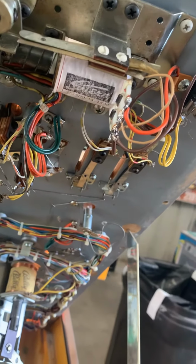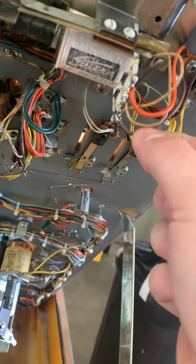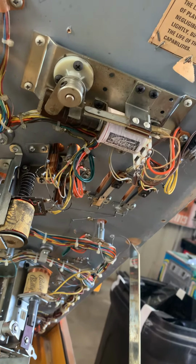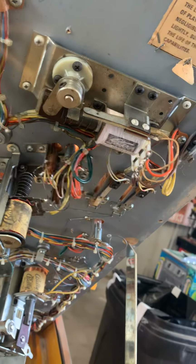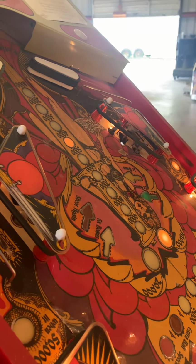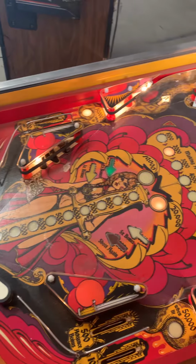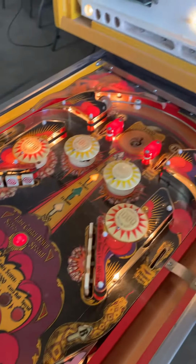After replacing the missing flipper coil and restoring the connection from this to all the other solenoids, we've got a flipper again. And all of our solenoids work as well. Both of our slingshots, our 2 drop target resets, all 4 pop bumpers, and this whole kick out as well. All our switches and lights seem to be working as well.